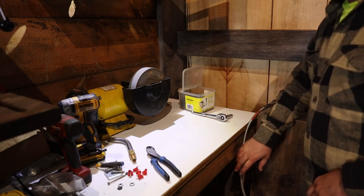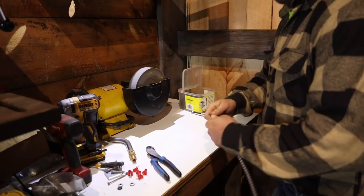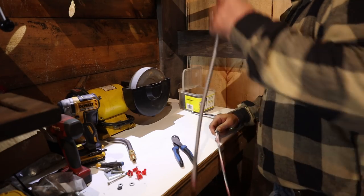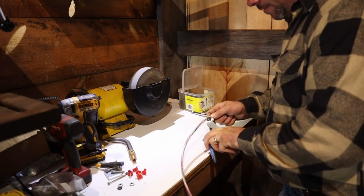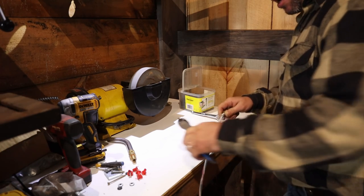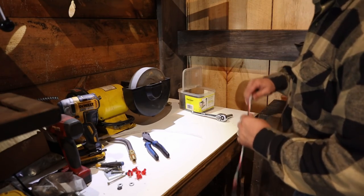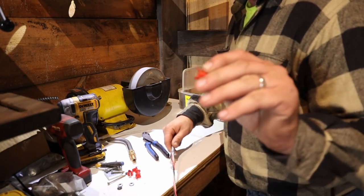One of the things that I am extremely fussy about is wiring and electrical work — I'm just very picky on it, and I like my wiring clean. You guys may not think it looking around at the extension cords and stuff hanging around, but that's out of necessity more than anything. So we're just going to run some 14/3 MC cable that we are going to run the forge blower and the exhaust fan off of. I'm running three wire because I'm going to be doing a little overkill on how I'm doing this — actually quite a bit of overkill.